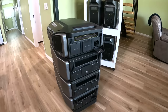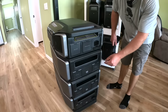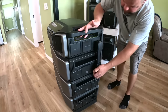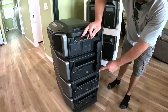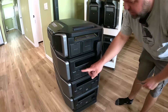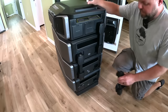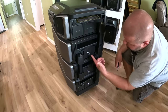One thing I love that EcoFlow got smart and did was some very good cable management - I'm very picky about that. On the side of these units, the covers flip down, they're magnetic, nice and clean. Look at these cables - nice and clean, nothing sticking and looping out. Go ahead and connect the inverter to one of the batteries - they snap in and lock, and there are additional locks right here to make sure the cables are never pulled out while in service. On the exact opposite side are additional battery ports, so we can crisscross - up to five batteries.